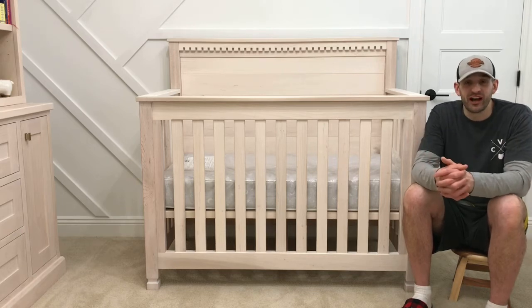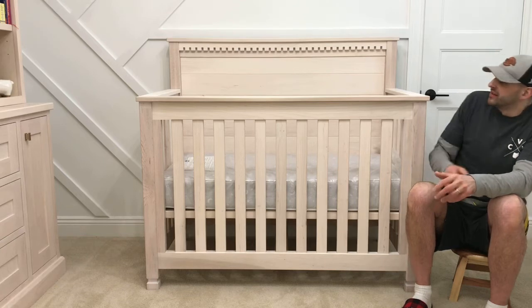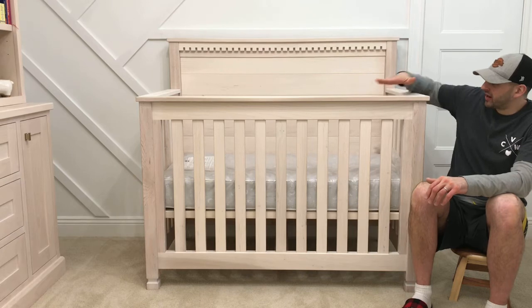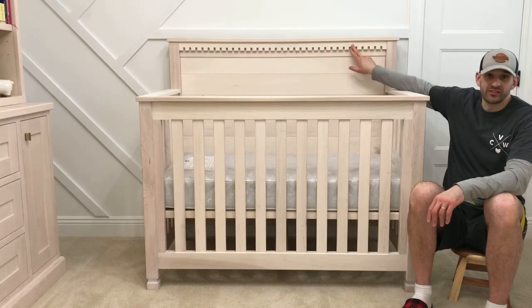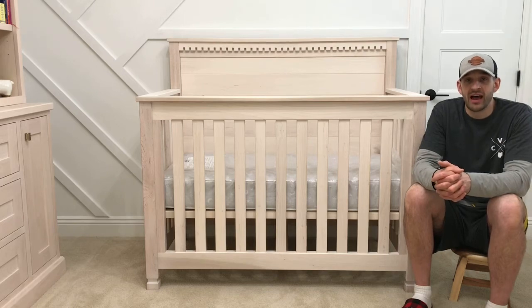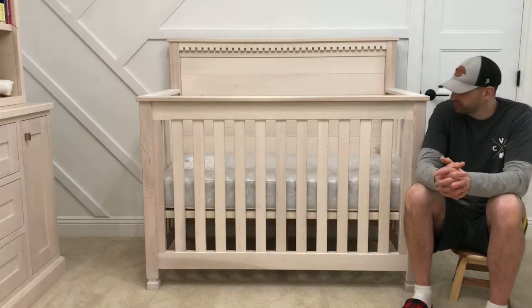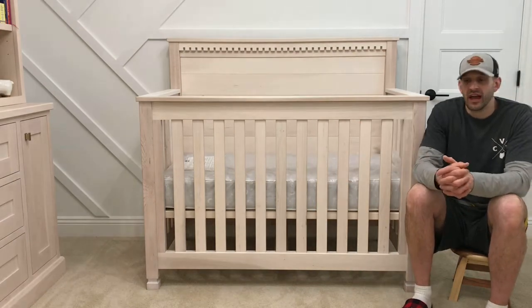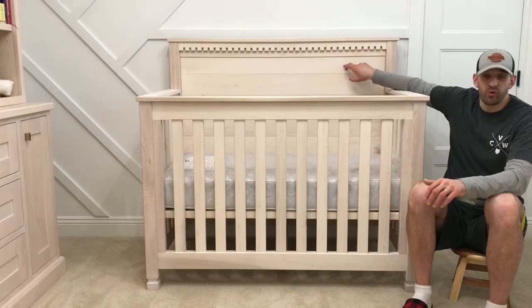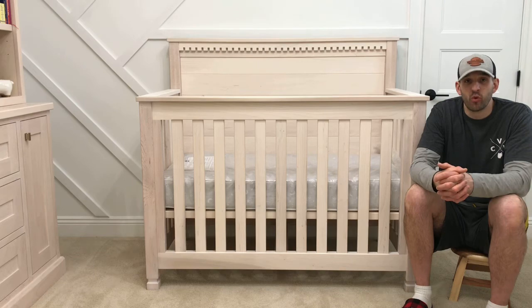This crib's made from soft maple. I've used 4/4, 5/4, and 7/4 soft maple. The tops of the front, side, headboard, as well as the dentil molding are all milled from 4/4 lumber, and they were 3/4 inch thick. The slats for the front and sides, as well as the planks on the headboard, were milled from 5/4, and those pieces ended up 1 inch thick.